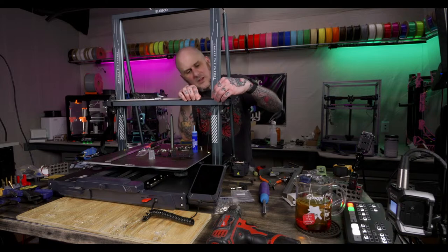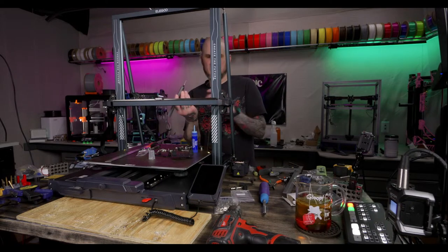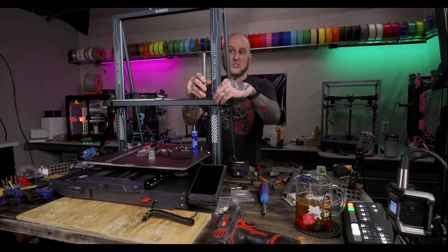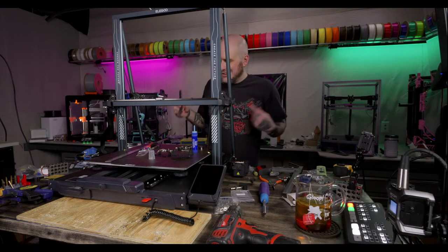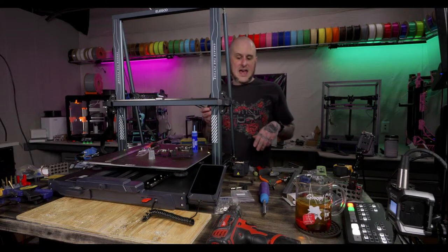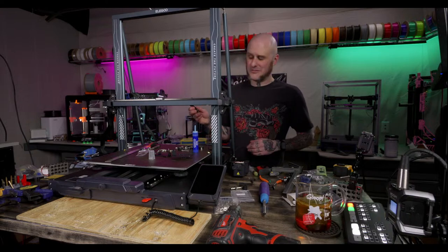I get it. Assuming linear rails are more reliable in your opinion, yes, I do feel that they are more reliable overall. If nothing else, less maintenance. You still need to do maintenance. You need to eventually disassemble, clean, and re-lubricate, but a lot less often than you're going to have to adjust V-slot roller wheels.